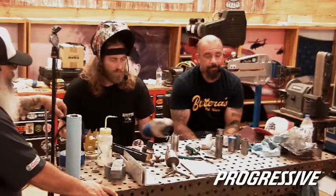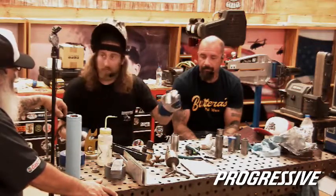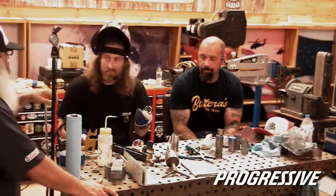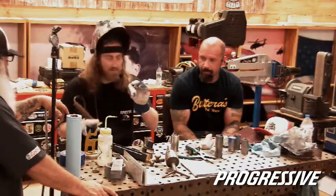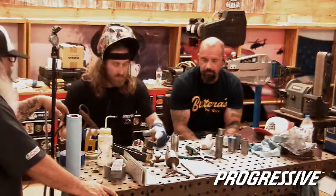And back to what I was talking about with Sharpie lines on these, lining stuff up for cuts. There's always a weld seam. This has one right there. The exhaust pipe, because of the way that it's wrapped, there'll always be a weld seam. So if you need to line it back up, you can reference that on the inside.